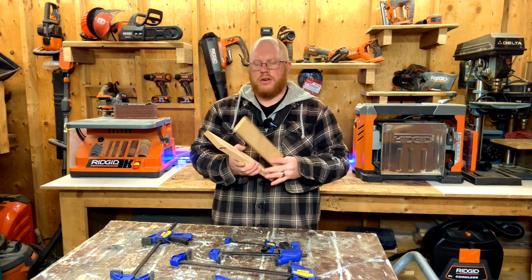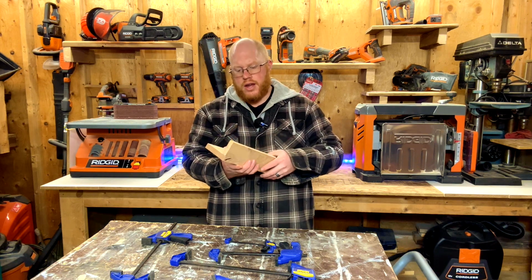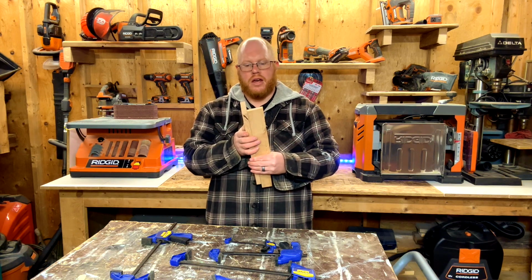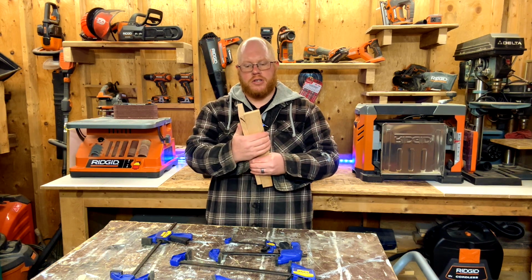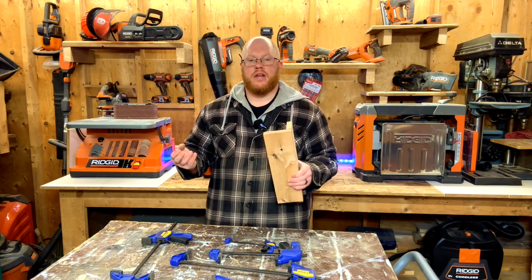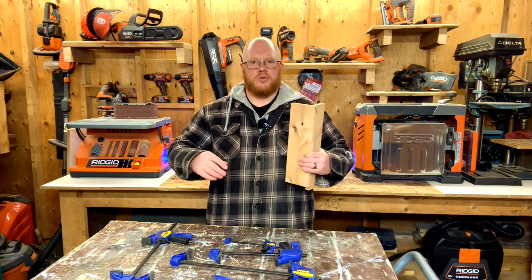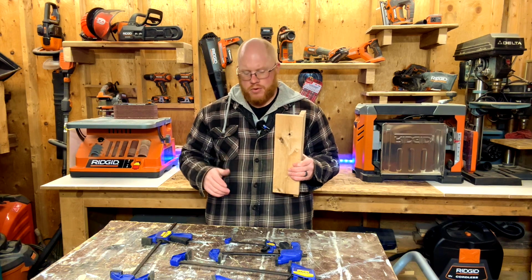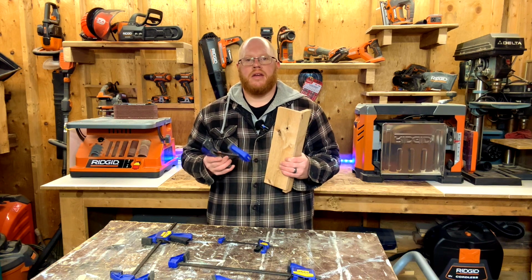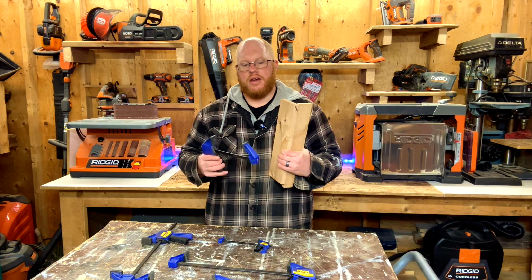So you need to glue the top board with your bottom shelf board, and basically you just line up your ends. These are 2 scrap pieces. You just line up your ends till it's flush, and a lot of times in the shop you only have your 2 hands, and with C-clamps and a lot of those other pipe clamps, you have to have 2 hands to navigate them. They're a little bit more heavy duty. So these easy clamps are great for shoring up your project quite easily.